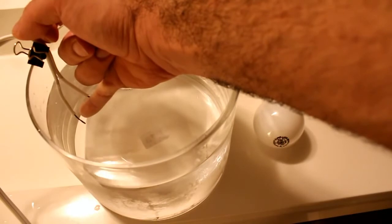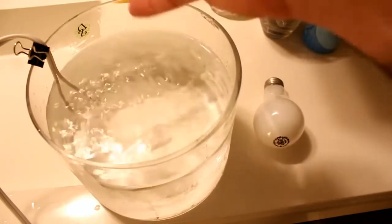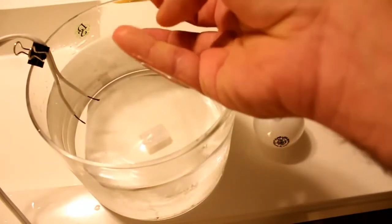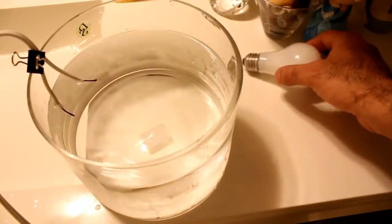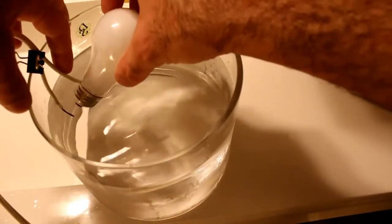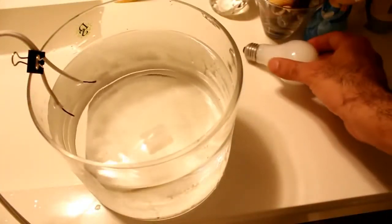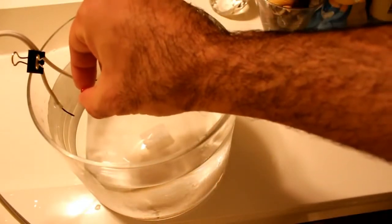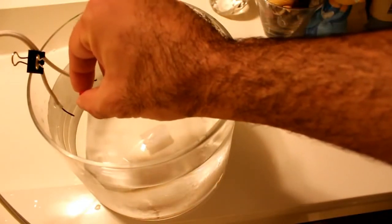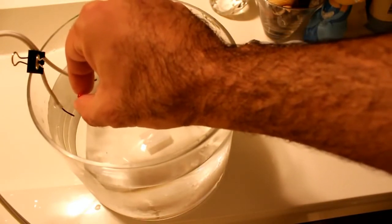Let's get closer to one of the wires. It's getting higher. It's getting much more painful, but definitely it's not too bad. I was expecting it to zap me to death. I readjusted the wires so that they are closer to the surface. I wonder, is it possible to turn on an LED just by putting it in the water? Apparently not much, because the resistance of the water is too much to allow enough current through the LED to turn it on.